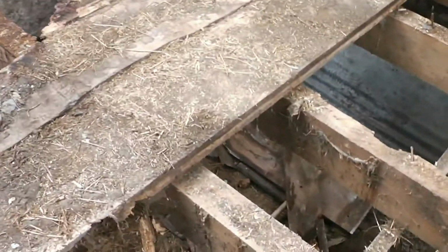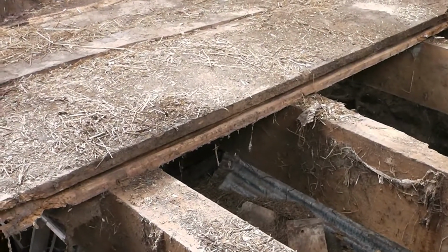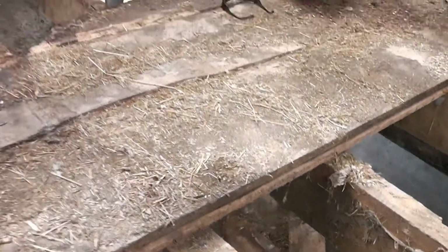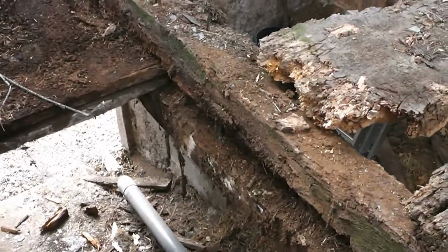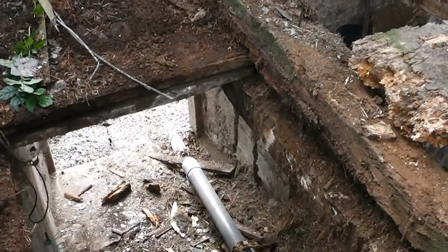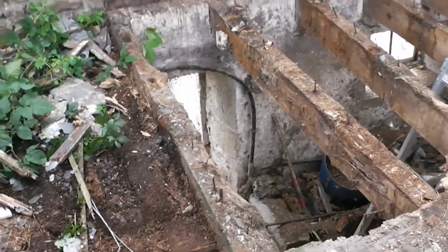You can see from those floorboards in there, they're very, very solid, very thick, and they've got tongues both sides, and then they've inserted kind of beads down the middle to lock them together. So they've really done a proper job when it was built. And in this one, they've got a thicker beam, and they've rebated it into that beam, which when that was new, solid oak would not have been the easiest job in the world. We'd probably have done that with hand planes or chisels.